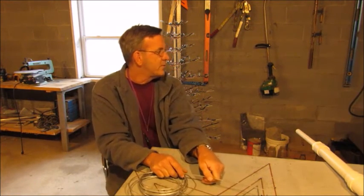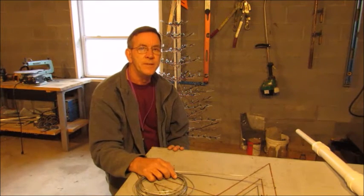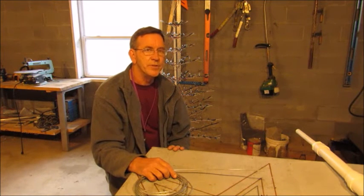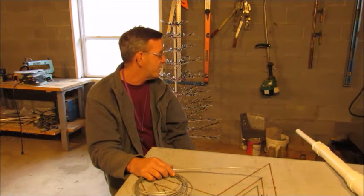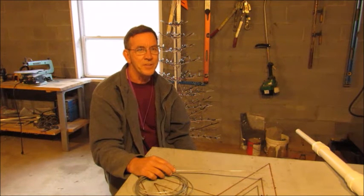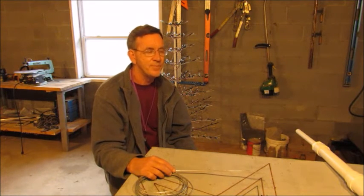As far as the lights, whenever we get to the build, I'll show you how to put these lights on. I'll be using 2811 bullet pixels. I'm figuring by the time I get through, I probably have around 8 universes going on this tree. This one behind me is 170 pixels on it. It's one full universe by itself, but obviously as the twigs get longer, it's going to use more pixels, and it's going to increase as it goes down. So I'm figuring probably around 8 universes. So one E682 will control this thing.